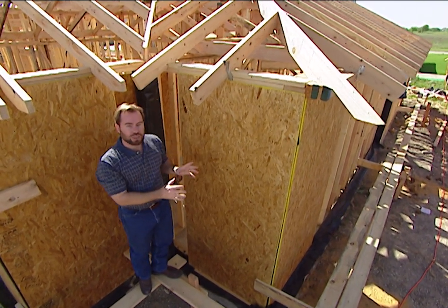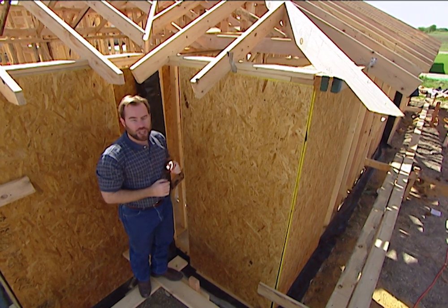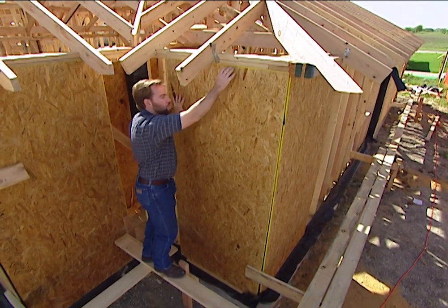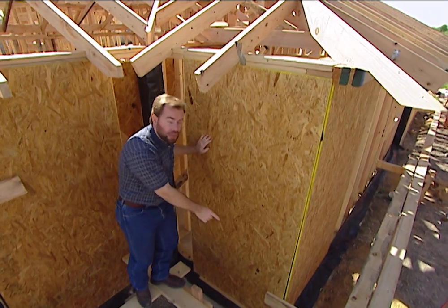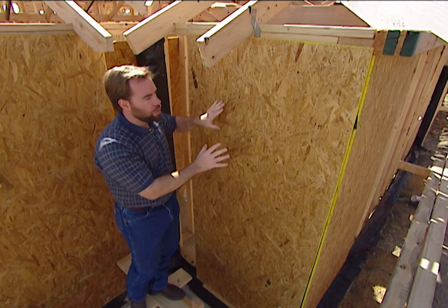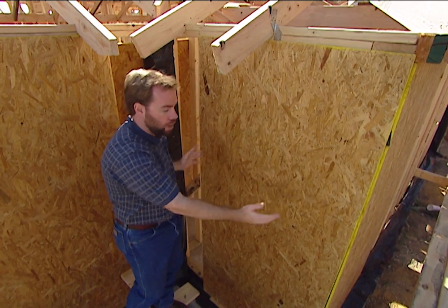On the corners of our house, we need to tie them together as well, because that would be the next weak link in our chain when we build a house. With our clip in place, we take a 4x8 sheet of wood and nail it to the top plate of our wall, then nail it to the studs going down, and then nail it to the bottom plate of our wall. This strengthens the integral structure of the house and prevents racking back and forth in high winds.